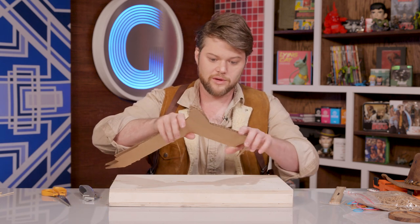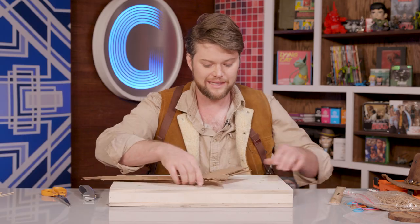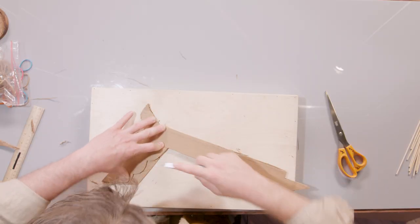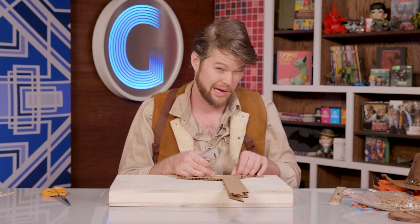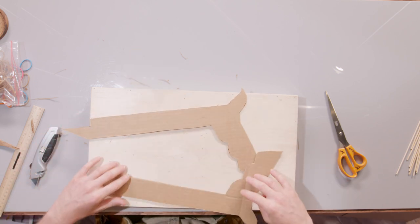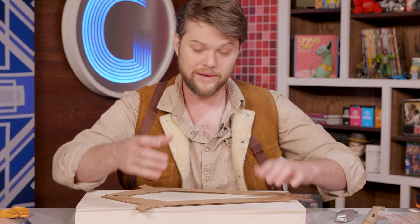It's starting to be a little hard to see what I'd actually cut all the way through on, so I basically cut around my line, and now that it's separated from the bigger piece, I can actually go in and do a little more detail work. It's always easier to cut more away than try to put some back. Now that we have the outsides of our crossbows, what we need to do is give us some more width to our crossbow for more rigidity and security. We need to cut those pieces specially to have certain gaps in them, to make room for all of our internal workings — our locks, trigger mechanisms, and everything like that.